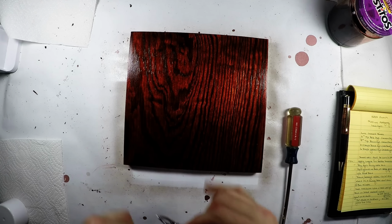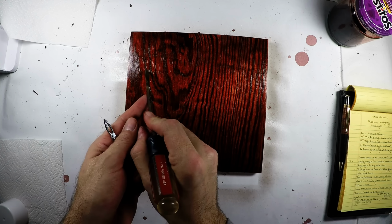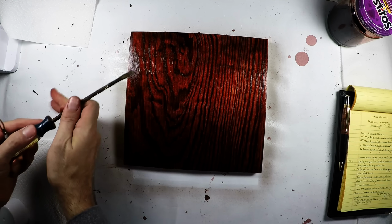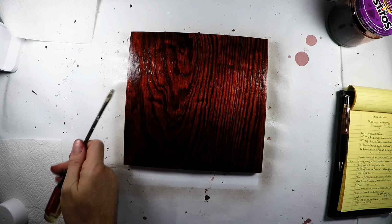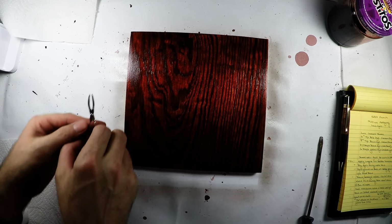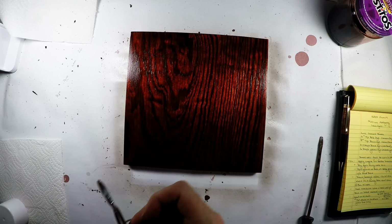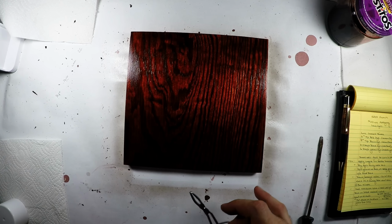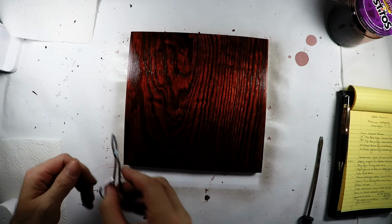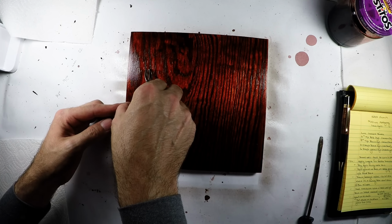Okay, process. So this is the board that I sprayed the shellac on. Basically, I've noticed something here: I have somewhat of a small defect in my top coat right here. Not sure how well that's going to show up on the camera, but there's a piece of probably fuzz from my sweater. I always end up keeping a tweezers nearby when I'm doing finish coating. Tweezers, sometimes a pin, but this is going to be the appropriate tool for this.